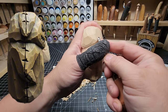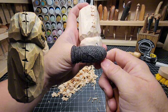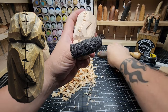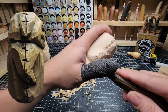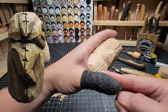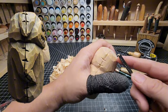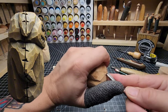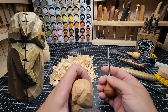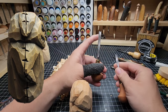If you don't have a V tool, honestly, the first tool I suggest people pick up past a knife is a V tool. A good V tool to start with is a number 15 or number 12. This one's a number 12, number 15 works as well. That's a 15 right here — both are good size. The 15 gives you more range because even if I'm using the 15, it's the same as using the 12, it's just deeper. But I don't have to use all that depth.